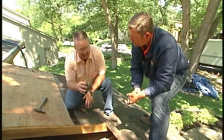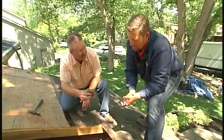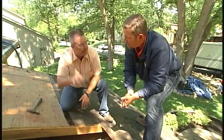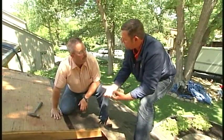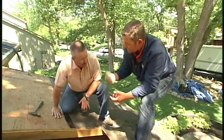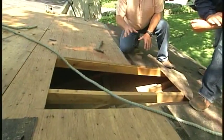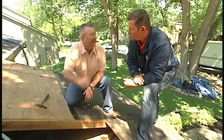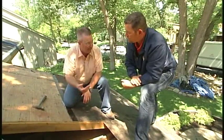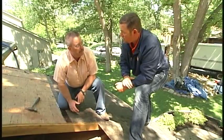This is a great example of how fiberglass insulation does a great job insulating but doesn't stop airflow — it really filters it. Going the extra mile to seal all the attic penetrations means fiberglass can do what it's meant to do: keep the heat in the house. When not spray foaming an entire house, cellulose would be used because it stops airflow a bit more. But when spray foam is being applied to a house, blown-in fiberglass can go over the top because you can reach the desired R-value with fewer inches. This project shows how a true professional company handles all aspects of a home remodel, because the house acts as a complete system — change something in one area and you might affect another.